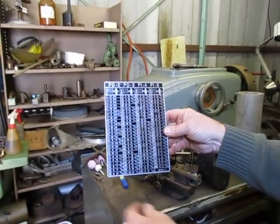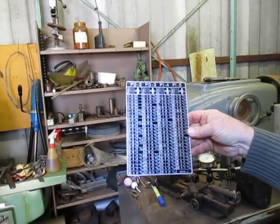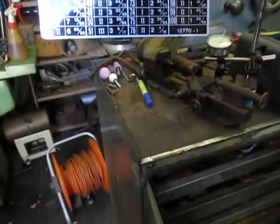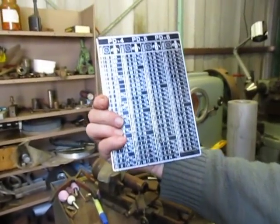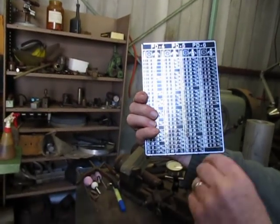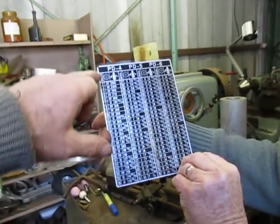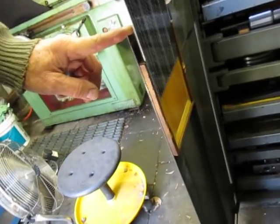To assist you to do dividing head divisions on your rotary tables, they supply that particular plate. It tells you direction, teeth numbers, and plates one through to five, going up to a hundred divisions. The flip side has more on it — also up to a hundred but in a different series, with the different plates marked by numbers. One side uses Roman numerals. These are the divisions up to a hundred on both sides, and the plate just slips into its own little wooden container in the door.